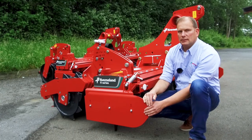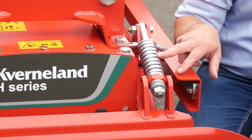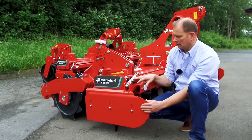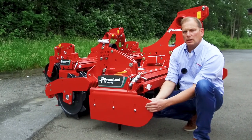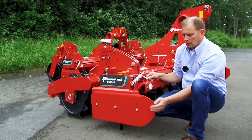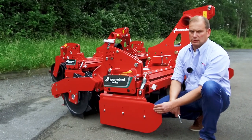The aim is that the clods will stay in the machine. To achieve this there is a spring-loaded protection which ensures things stay in the machine. When the machine is above three meters in transport width, if you want to drive on the road you just have to remove the bolt and lower the plate, bringing it below three meters. You can then drive securely on European roads.